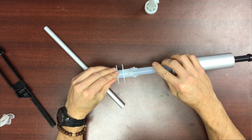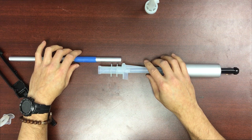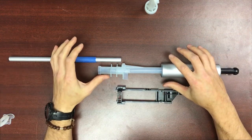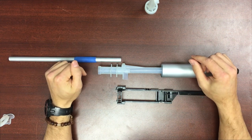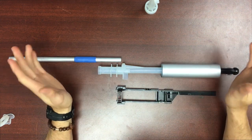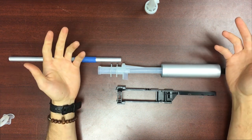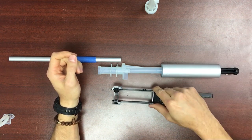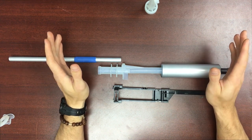That's the layout in the blaster, with the barrel installed and your bolt sled. This is a pusher design only — if you want to shoot long darts, stick with the stage 1 and 2 kits, which are essentially ideal for shooting full-length darts. Or simply put a 14 kg spring with a better trigger catch and maybe a bolt sled in a stock long shot for all your long dart needs.